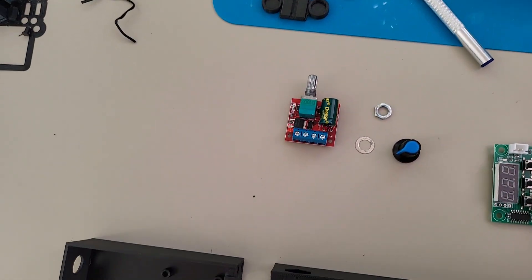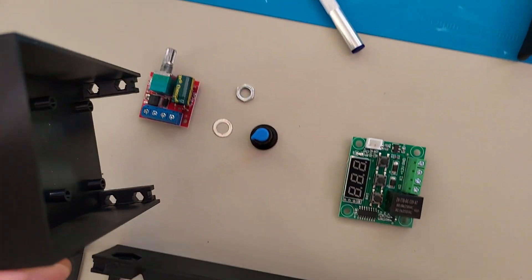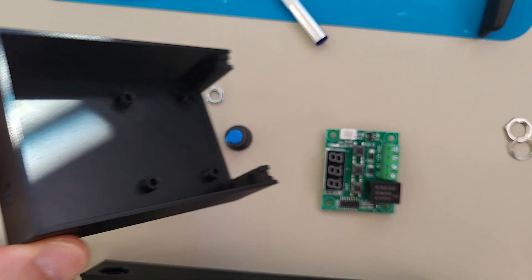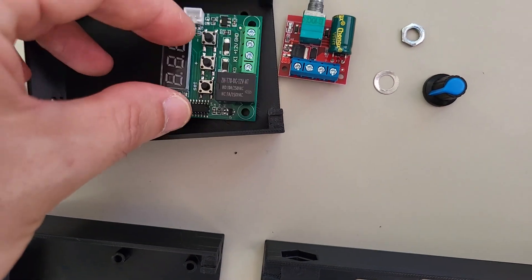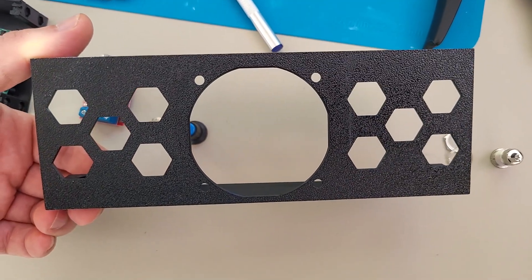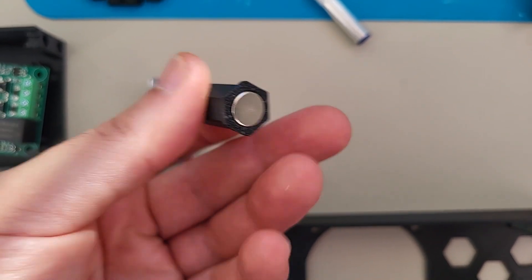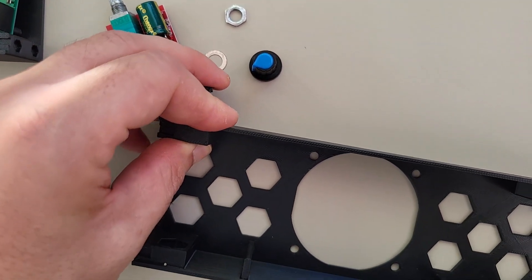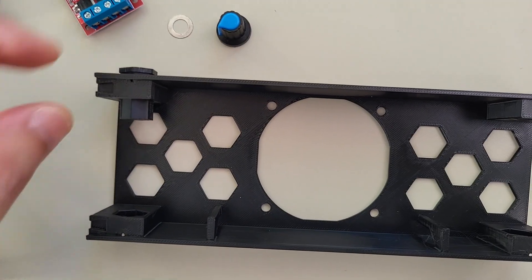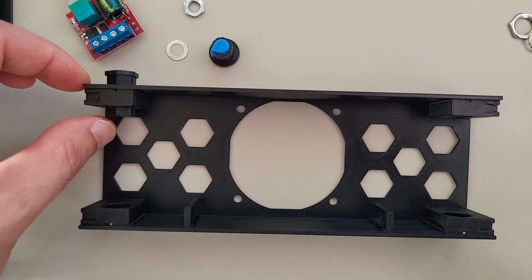Now let's see the finished 3D printed parts. This is one end of the whole assembly and here we will have the input - we will come with 12 volts here. Here we will have the settings for the PWM and also the thermostat will be mounted here. Then we have the sections - these are 190mm sections. We have these supports which we also print and mount a magnet in them. These come in these holes, and when we push the mount under the radiator the magnets will make contact with the metal and hold the whole assembly there.